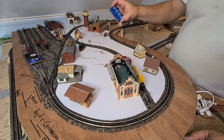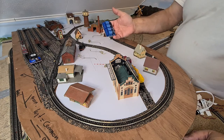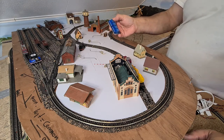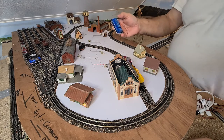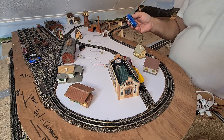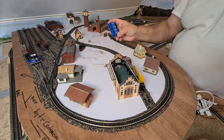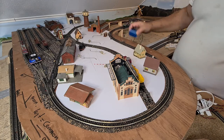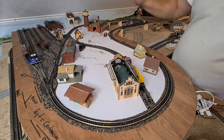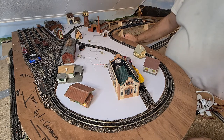Also the relays, the relay board itself, they run on 5 volts, at least this board runs on 5 volt. I also have a board which runs on 12 volt to control the relays. But at a certain point, due to the many relays which need to be driven, the Nano will go bad. So I need to make another solution for that. And looking at all, it's going to be a lot of current which is flowing through only the upper deck alone if I'm going to light up all the buildings.